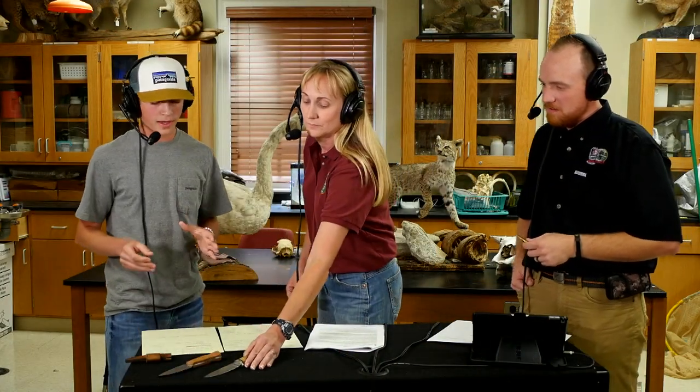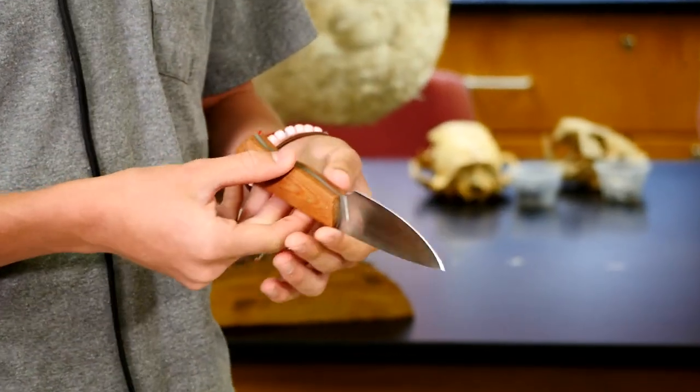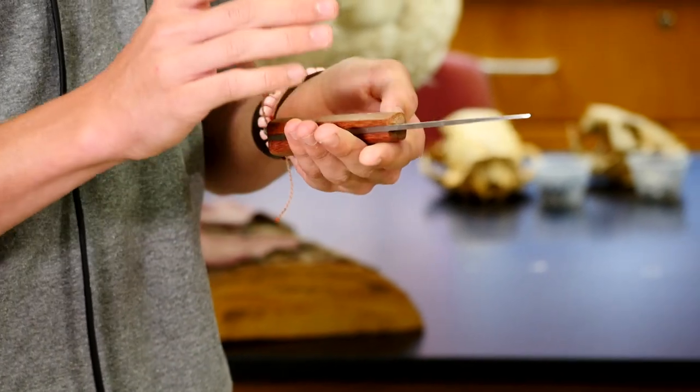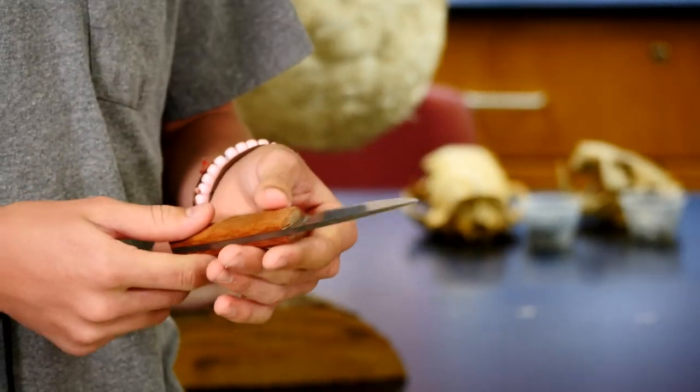Okay. And then from there, after forging and cutting and all that, you would go into grinding, which is one of the main parts of the knife, the bevel. That's the part where it goes from the thickness at the spine and it has to taper down to a sharp cutting edge. So your bevel is where you're going to spend most of your time grinding because it has to be really precise and even and go to a really narrow, thin point.